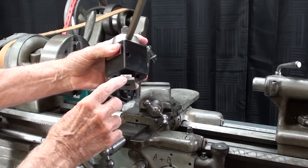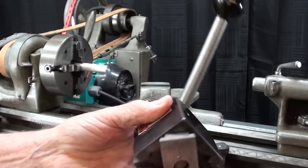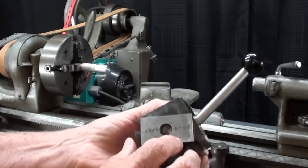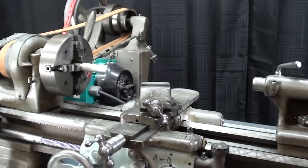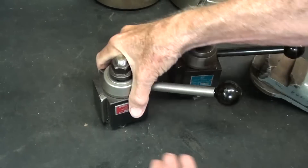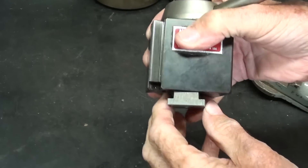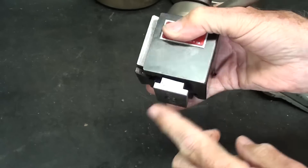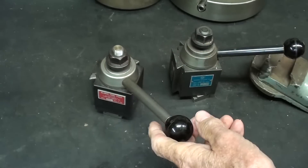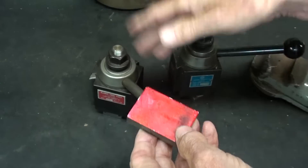This came off my Hardinge lathe. This is not the correct T-nut — it will not fit this — so the project today is to make a T-nut like this with a 9/16ths fine thread in it that will fit this compound. Let's go down to the other shop where I've got some materials laid out. From what I remember, a long time ago when I acquired this post, they came with a blank piece of metal that you had to machine to size. I believe it had the hole drilled and tapped in it, but essentially it was just a piece of stock like this, and this is what I am going to use for the T-nut.